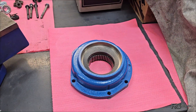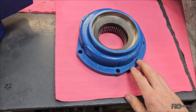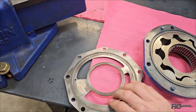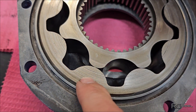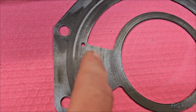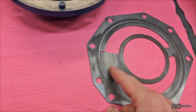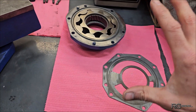Let's talk about this oil pump that has given so much trouble. This is the oil pump for the DT466. When we flip it over, you can see the gears inside are really scratched up, and on the wear plate that goes against it, it's really grooved in here too. If you listen, you can hear how a fingernail scratches over those grooves - these are pretty significant grooves in there.